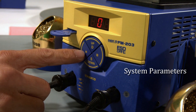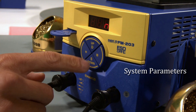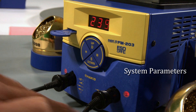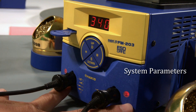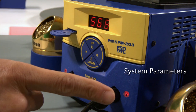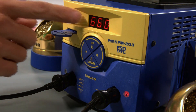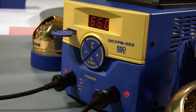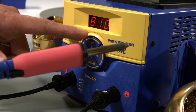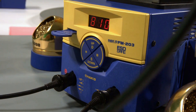Confirm here, and then the last thing you need to do is press down the star button to confirm your changes, or select no if you want to make additional changes. I'm done here, so I'm going to confirm my changes. Both channels are now lit up, meaning I have power and heat to both of my irons — right now I have a standard iron on channel D and a standard iron on channel S. Channel D is flashing, telling me the display is showing my temperature setting for channel D. Now I pick up the iron on channel S.